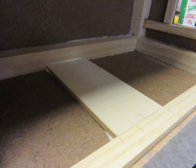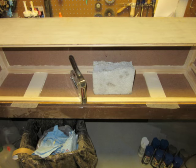While the latch keepers are usually so close to the edge of the case that they are screwed into the stringers, the latches themselves are out in the middle of the masonite, and so they need reinforcement. Instead of using wood strips for this, I usually use some quarter-inch plywood and use regular wood glue or Gorilla Glue to glue those into the panels. They're stressed sideways relative to the masonite. They're not pulling outwards, so I think this is perfectly strong doing it this way.